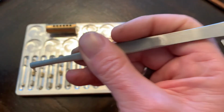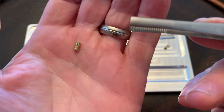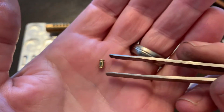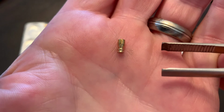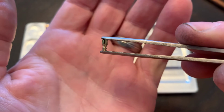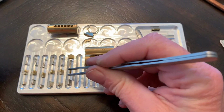And that's the number one beautiful homemade spool. This is taking longer than I thought it would. And number two, nice, beautiful serrated driver. And number three is another beautiful serrated driver. And the light-lipped serrated driver in four. It's this one though, guys. This one. Look at this. Reduced diameter, fine serrations with kind of that beveling to get to it, but they're reduced diameter. So it's like a double step pin, almost like a Christmas tree, but a Christmas tree normally would have one large ring. And then in number six, just an extra wide serration in that.